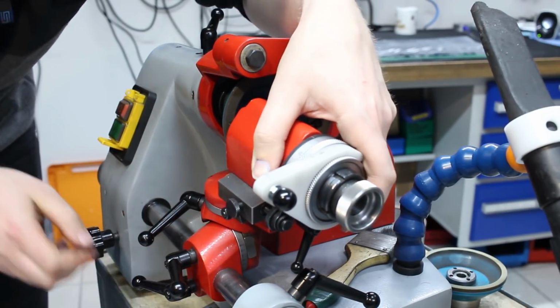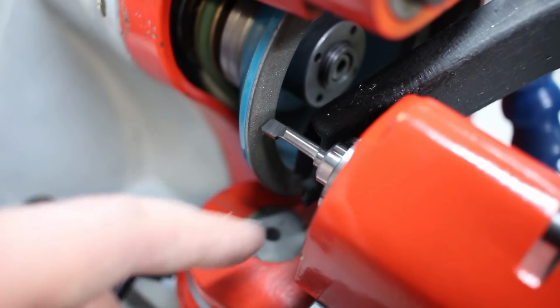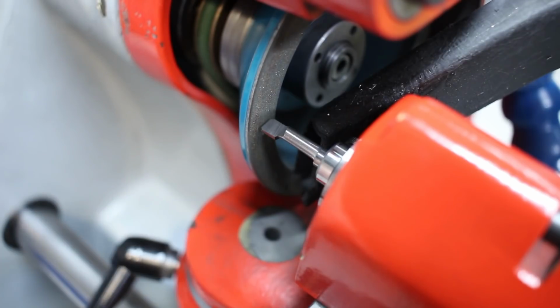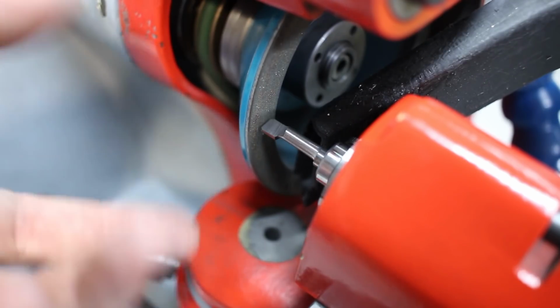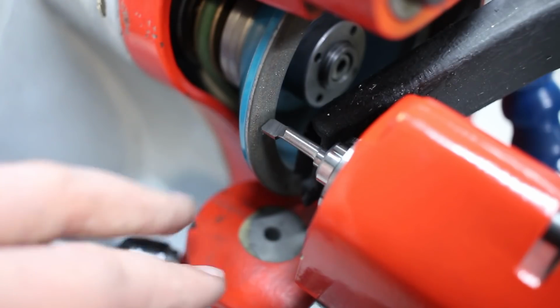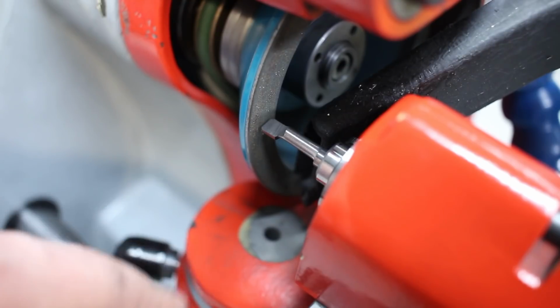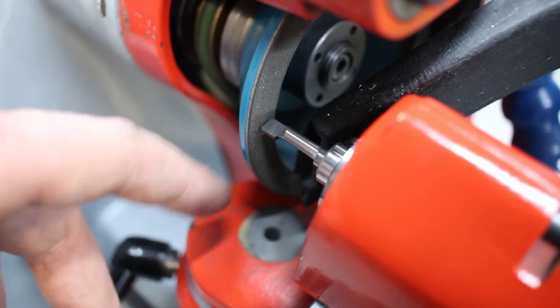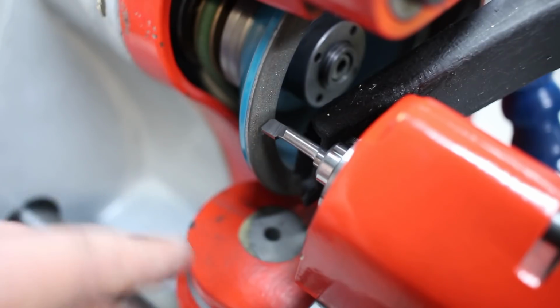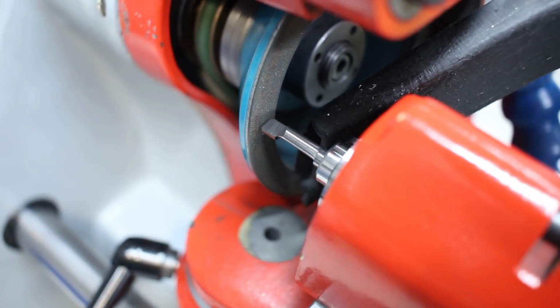Just like this. With grinding carbide, dust extraction is really a good idea. The carbide dust is not only bad for you, gives you cancer and kills you over time, but it also is really bad for your machinery. Carbide dust gets into sliding surfaces between ways and stuff like that, and it wears down like crazy. It's like a lapping compound, dry lapping.